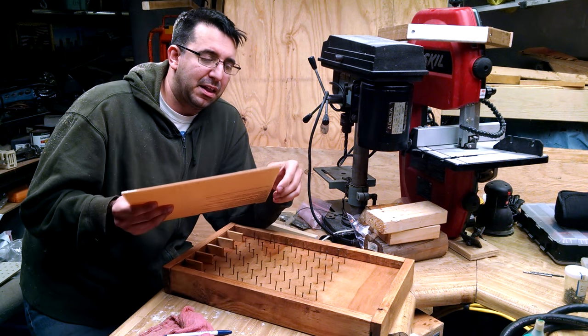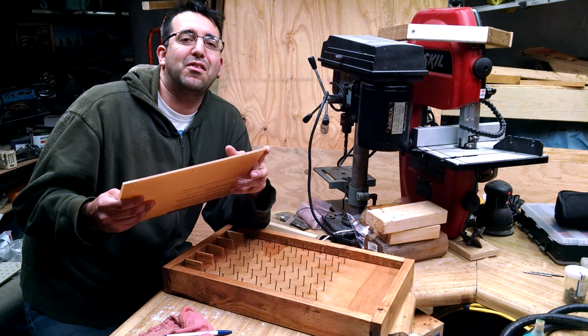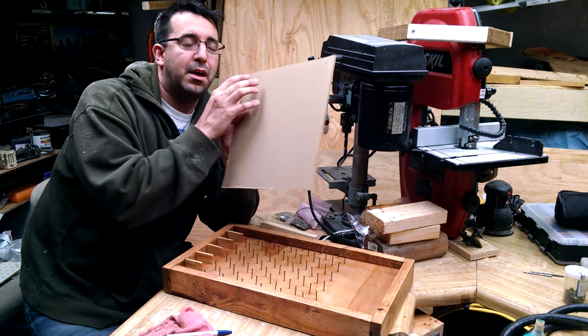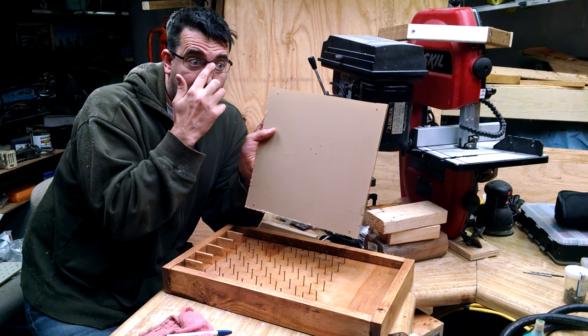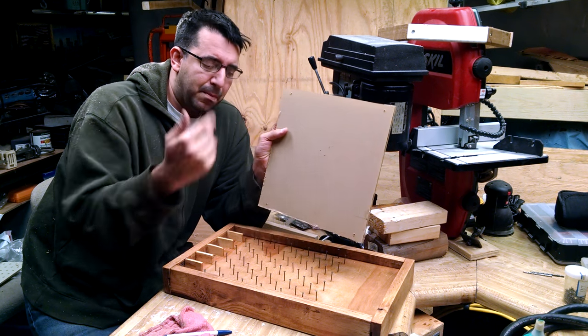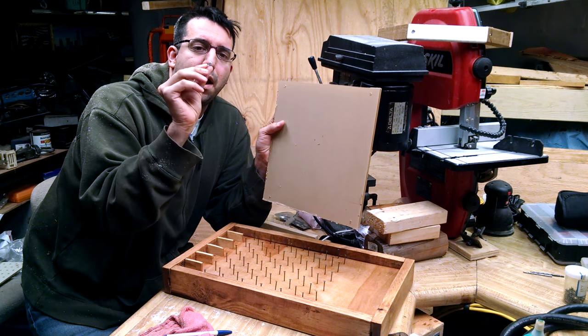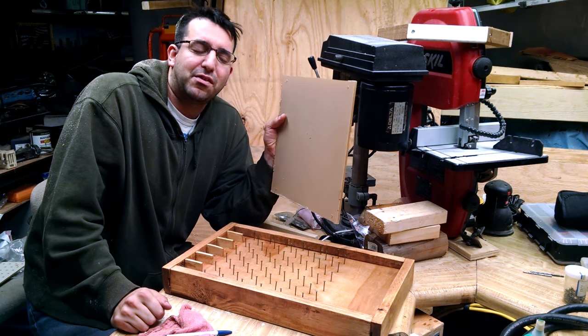So, anyway, the sides of this match up pretty well. I may have to sand the edge, but whatever. It came out pretty nice. I did a step-up method for drilling the holes. I did a very small drill bit at first, and then a much larger bit. The screws I'm going to be using are these little 3/4-inch button heads. It should look pretty nice when it's done.